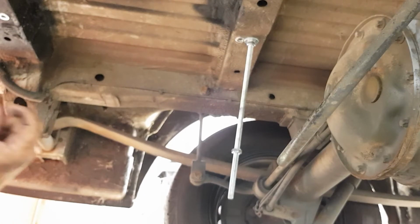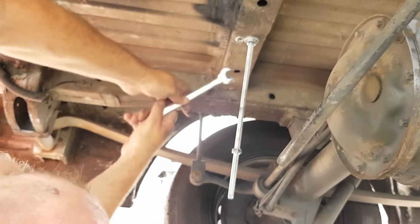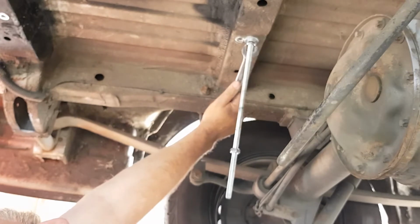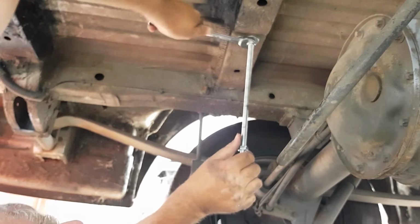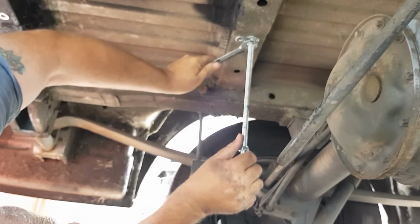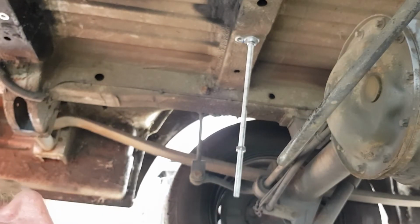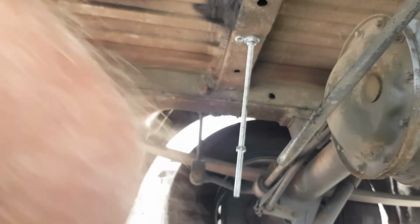I've got 2 inch in there. Just tighten her up. Make sure you pull them good and tight. Try not to bend the rods. Also, be sure you don't overtighten them. Although the rivnuts are good, yank too hard on them, they will strip out, they will start to move, and then you will be stuffed, because they're a beggar to get out afterwards.